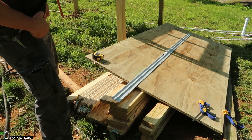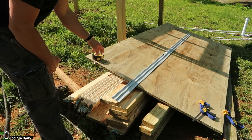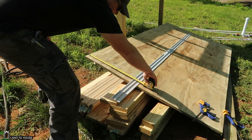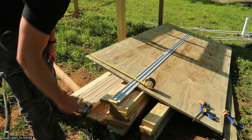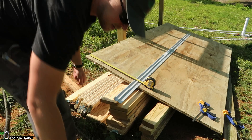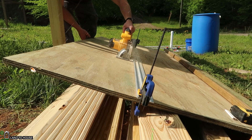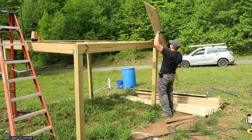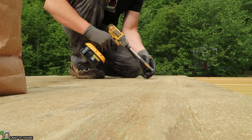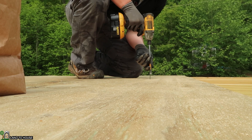Because I'm adding the front porch as a decking board build, it's going to make my actual floor of the Playhouse a little strange. It is going to have an extra 18 inches of plywood here. So I'm going to use my tape measure to mark this out at 18, then use my straight edge with my circular saw to cut this out at a foot and a half. I'm using the same two-inch Torx exterior screws to get this piece locked down to the frame.